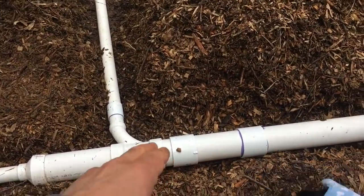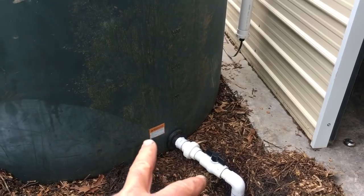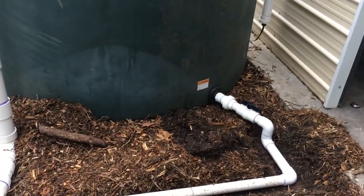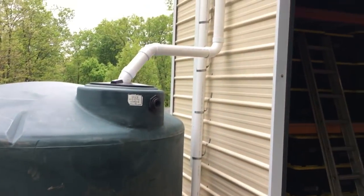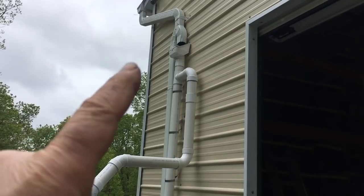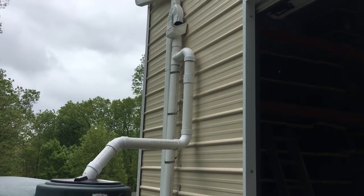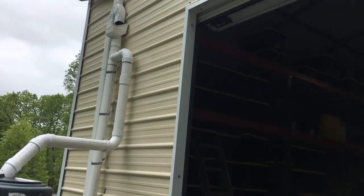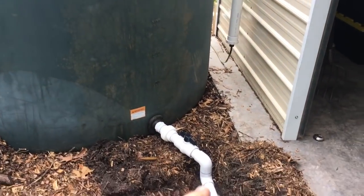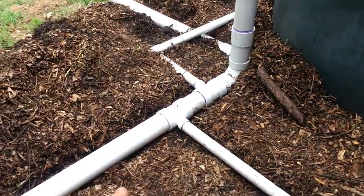Moving on, coming back across the four-inch pipe, we tee off and this is where we hit our other 1,550-gallon tank. The 1,550-gallon tanks are for storage, and they are actually collecting rain on the top side from the gutter. Each 1,550-gallon tank collects rain from a gutter on that side of the garage. The garage is 24 foot by 51 foot, and because it's an A-frame peaked roof, I get half of the water on each side. Same thing on this one — I have a ball valve and a quick disconnect so I can shut it off.